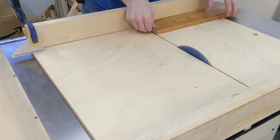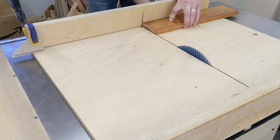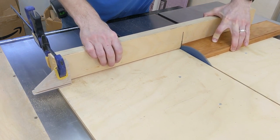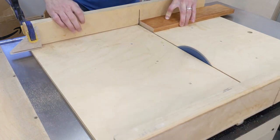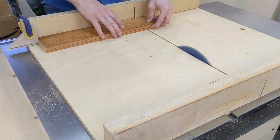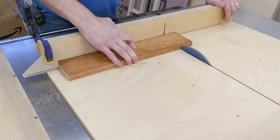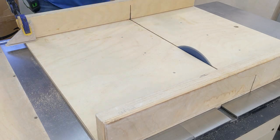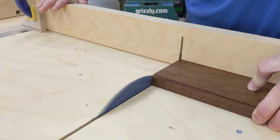I can now finally get ready to cut the miters. I start by squaring up the ends of each set of sides and cutting them to length. Both halves are cut at the same time to ensure an equal length is removed from each part to maintain the grain match. The boxes will have a final outside dimension of nine by five and a half inches, so the parts are cut to exactly 14 and a half inches long.